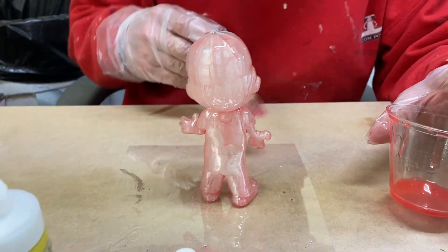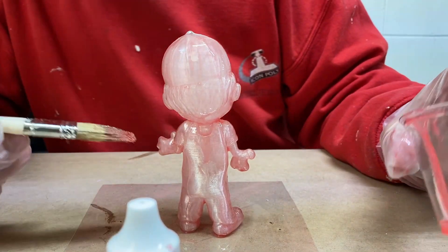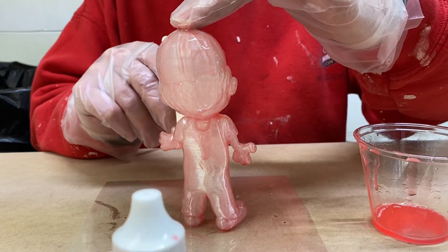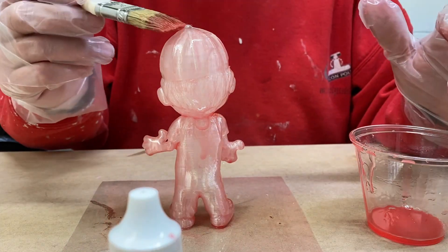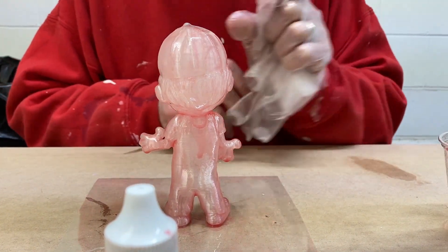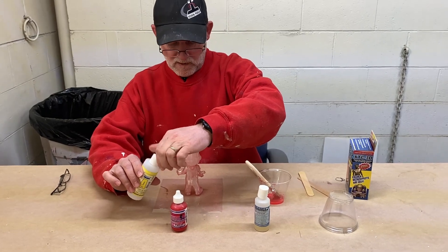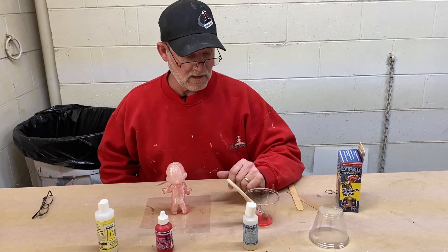I'm going to put a little extra on his bill because there are striations on top, but I'll watch for runs — I don't want it building up in certain areas. I'll just babysit this for a couple of minutes. This stuff is sandable too; it sands kind of hard but it's not a big deal on something this small. There you go — he's coated. Now we're going to let him sit overnight and tomorrow we'll be able to crane him up and pour a silicone mold. Thanks for watching and stay tuned for more videos.